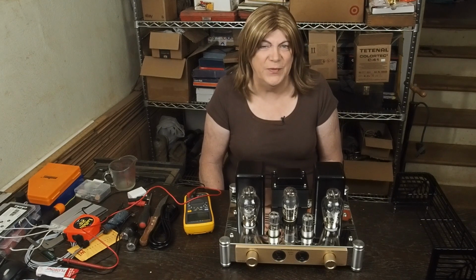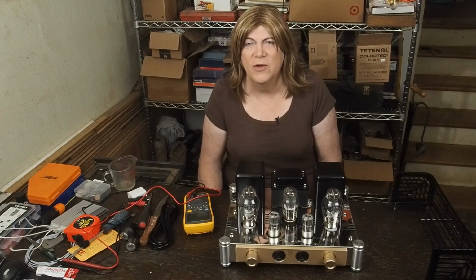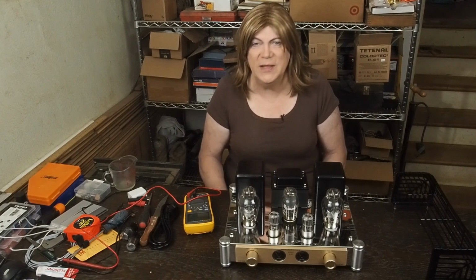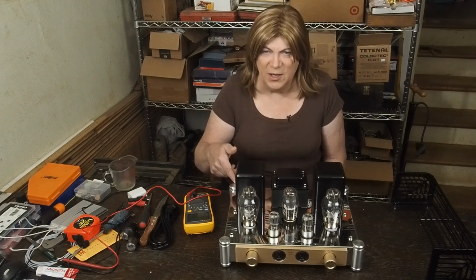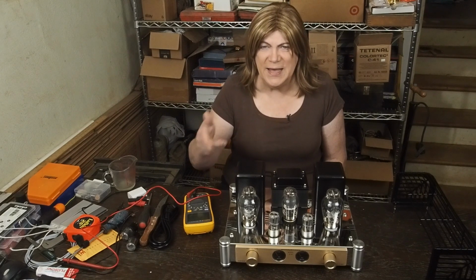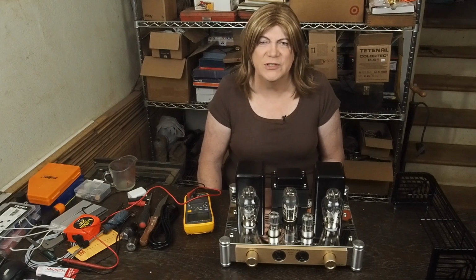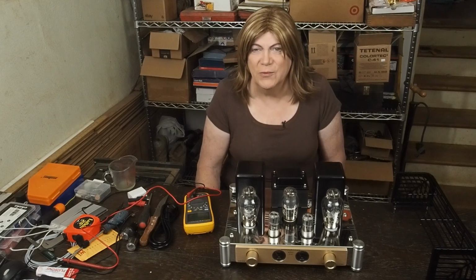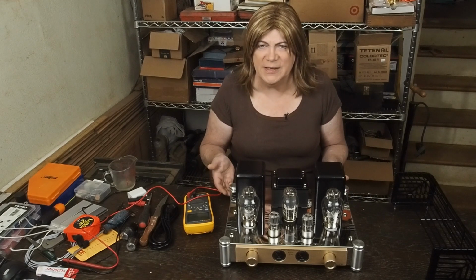But I just feel like there's something missing, especially when I was doing A to B with the 300B amp that I built after swapping the front end from this direct coupled dual triode to a cascode that acts more like a pentode and gives a lot more voltage swing to the 300B. So, if you're buying one of these, plan to use it out of the box.